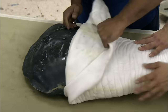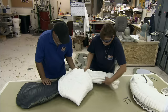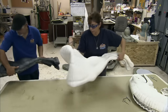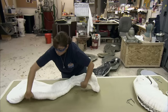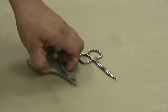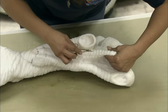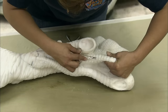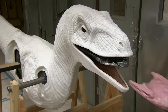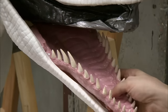The skin is then removed from the inner shell for manual touch-ups. Ensuring the fine details are absolutely precise is critical if the dinosaur is to be realistic enough to have the audience jumping out of their skin. Any small strips of excess silicon, known as flashing, must be meticulously trimmed off to make clean, seamless joints and to enhance the realism of the skin. The moulded acrylic denture is then inserted into the skin of the lower jaw to ensure that its fit is seamless.